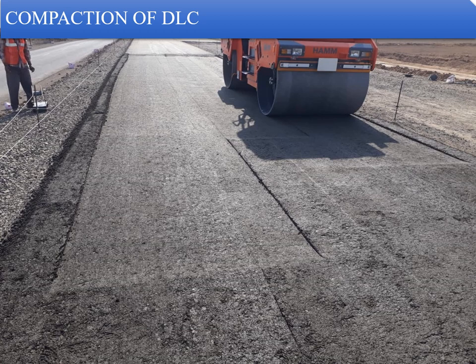If the mix is exposed to sunlight before or during rolling, the loss of moisture will be high and you will get less compaction with the same compactive effort. The first precaution is that compaction must be done as early as possible. Ideally, paving should be avoided when the temperature is very high, because the high rate of moisture loss will prevent achieving the required density, and you may get an irregular or segregated surface.